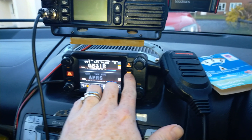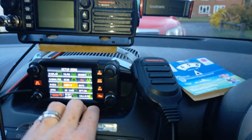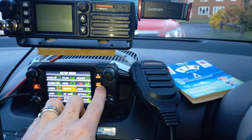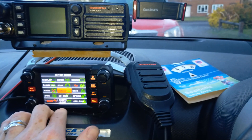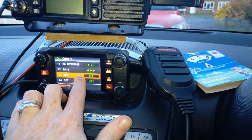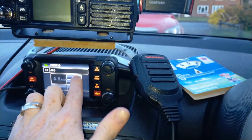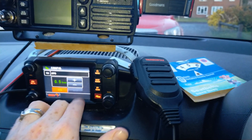To set that, you would press Display on the front of the FTM-400 — press and hold the Display button — which will go into the setup menu. Select Config, then item 13, which is APO. Then you need to switch it on first.